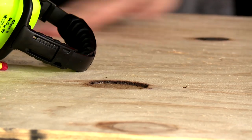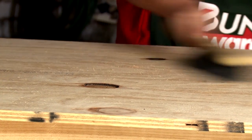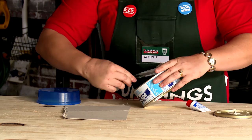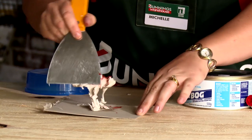Preparation is really important to get a really good paint finish and plywood is no different. So what I'm going to do to start with is clear off my bench and fill up these holes with builder's bog. I'm going to give the bench a good dust down first, then fill the holes. I've got a bit of cardboard to mix it all up on, but the key of course is the hardener. The more you use, the quicker it's going to set, so you need to work really fast.